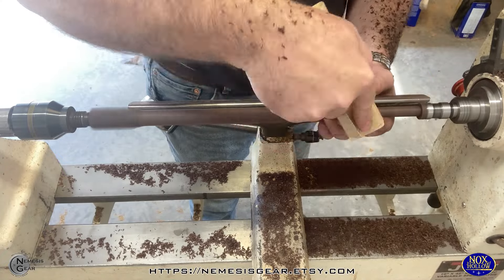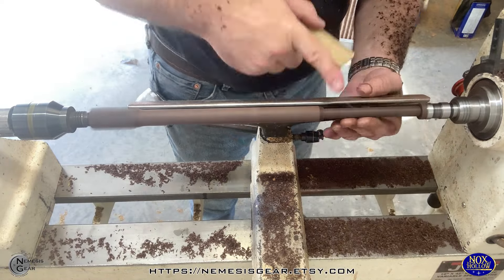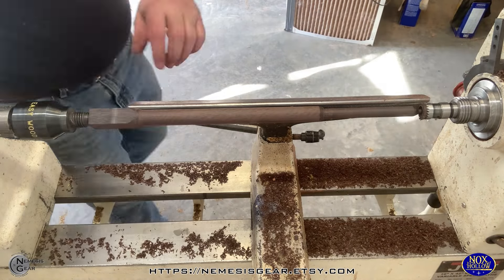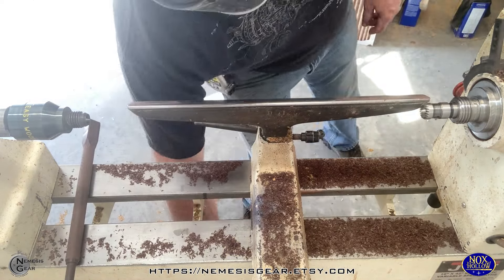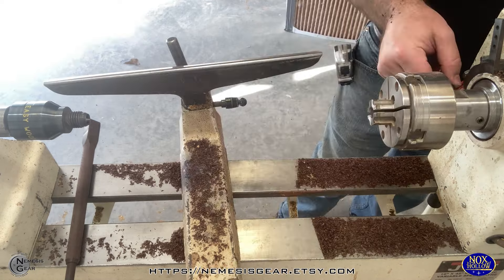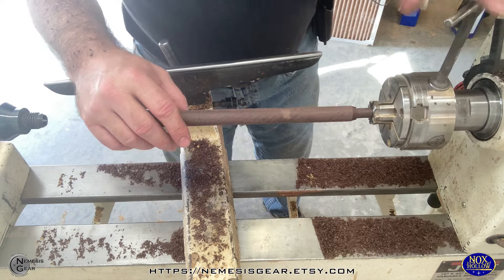I'm starting this video right at the very beginning, so we're getting the whole wand-making process. If you don't care for that, you can skip to about five minutes in where I start doing the handle. Basically, I'm getting the wand from a square rectangular piece, turning it down to a round shape, then turning the blade of the wand down to about the size of a Sharpie — just under a half inch, around three-eighths of an inch — so I can put it up inside the chuck jaws with less unsupported length.